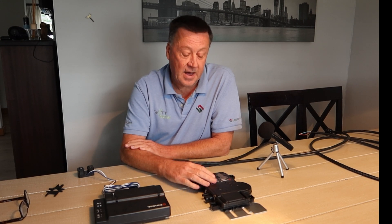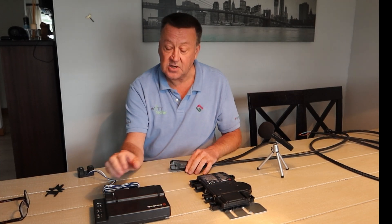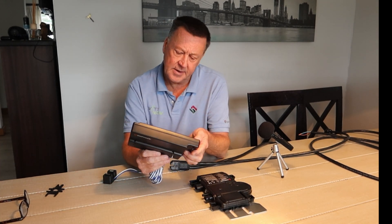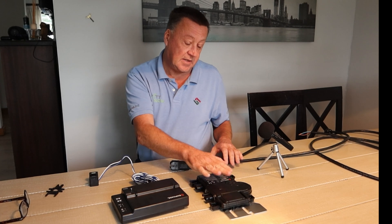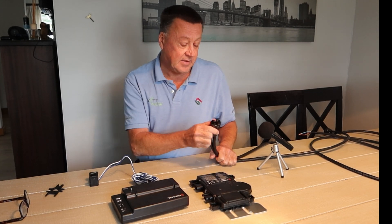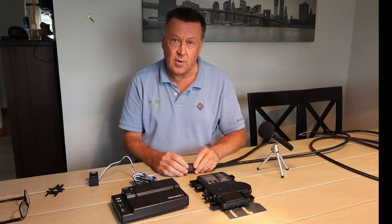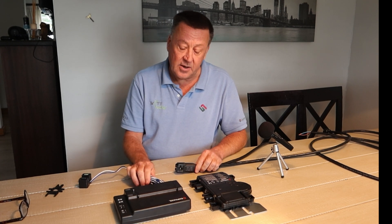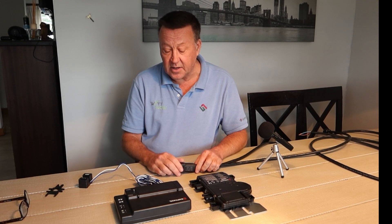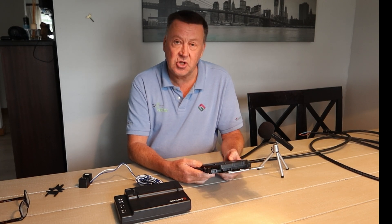You can eliminate quite a bit of infrastructure by having an inverter on each panel that delivers AC directly. The system is also three-phase enabled — so are the cables and the gateway — and that makes it pretty versatile. There's a big saving on wiring. Once this micro inverter is connected to the rails, it's a plug-in kind of job and you can have a whole string of these on one AC cable. Termination is quite simple and goes directly onto standard AC wiring. If you'd like to follow me on this journey, please hit the subscribe button. I'll be working with some of the technical guys at Victron, Kurt and his colleagues, as well as Justin and the technical team at Enphase South Africa. It will be an interesting journey to follow — let me know in the comments if there's anything else you'd like to know.